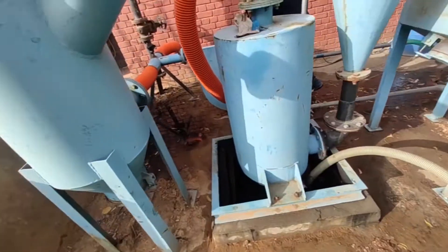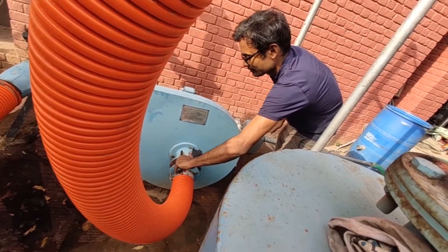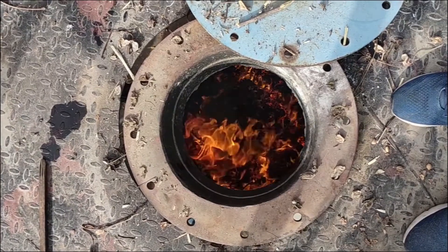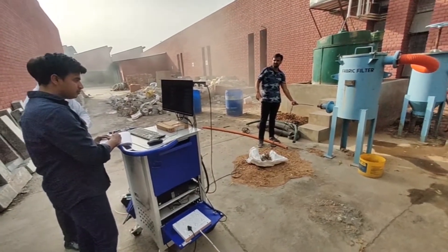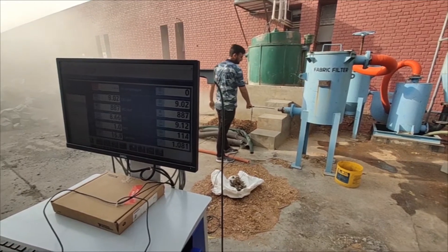The rate of airflow has been changed with the help of a butterfly valve knob present at the blower. The anemometer has been placed at the open duct to measure its reading. For each set of air flow rate, gas composition has been measured by gas analyzer to calculate the heating value of the producer gas and gasification efficiency of the gasifier.